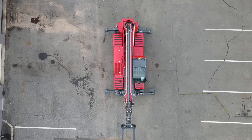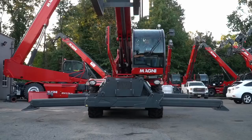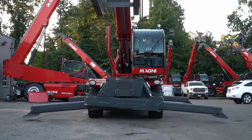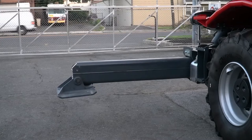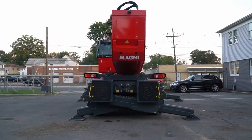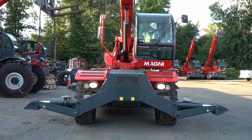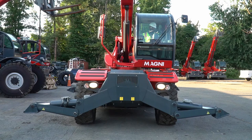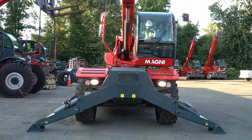Magni offers two different types of outrigger systems: scissor and pivoting. The scissor type are found on Magni's larger machines, starting with the 6-ton models. These can be managed together or individually to perfectly adapt to each workspace, and provide unlimited placement due to a proximity reel in each outrigger. Regardless of extension amount from 0 to 100%, the machine provides the best possible load chart for each quadrant. When closed, scissor outriggers do not affect ground clearance. Magni's pivoting stabilizers are found on 4- and 5-ton machines, simple to deploy, and when retracted remain entirely within the machine's footprint with no protrusions.